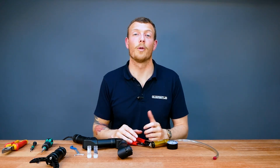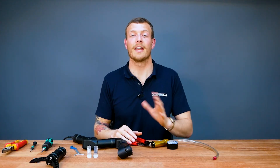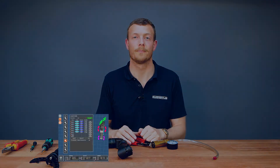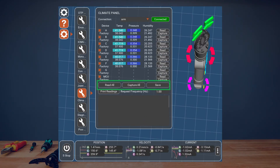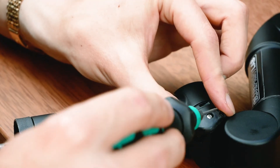Double check all the pressures inside Reach Control. Axes A through to F should all be between 0.3 and 0.4 bar. If any of them range outside those values, re-pull the vacuum in that module. Then click Read All, Capture All, and Save. The final step is to replace the vacuum port cover that we removed at the start.